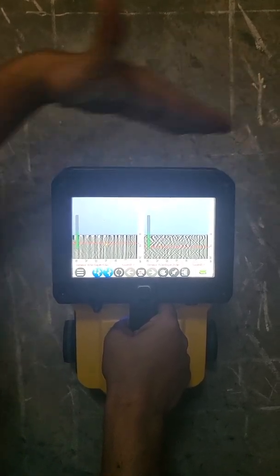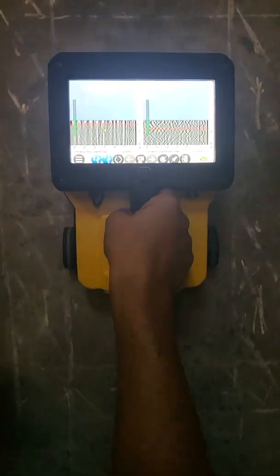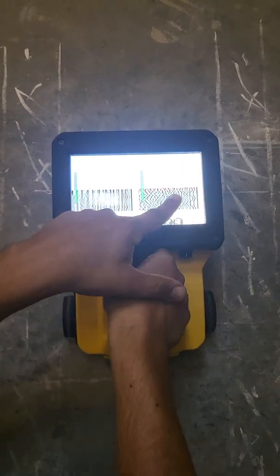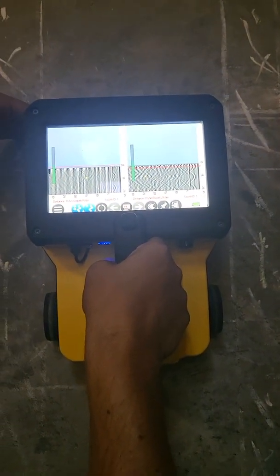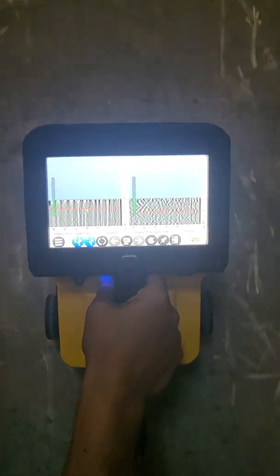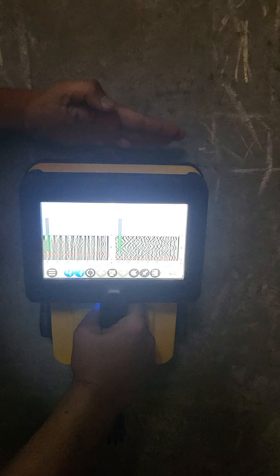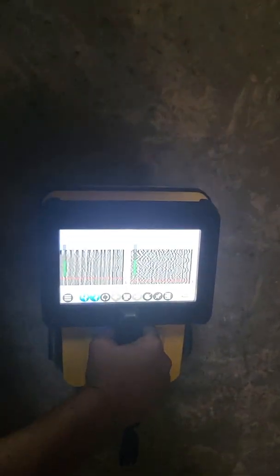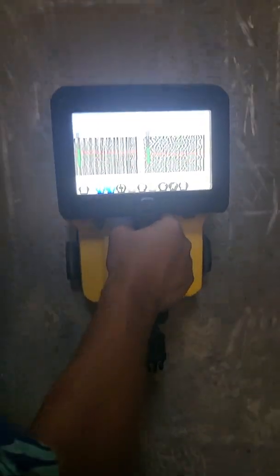You can see we've marked out some rebar — there's one right there. If I push it back up, I'm bisecting another hyperbola and on another marking. Coming back down, I'm bisecting another hyperbola and here's another one. If you continue to collect additional data, here's the next one — I would mark it right here. That's as simple as it is.